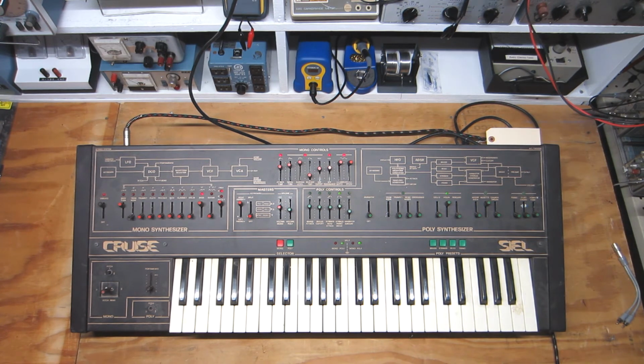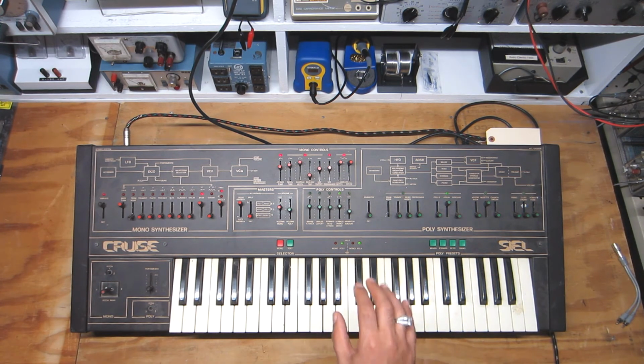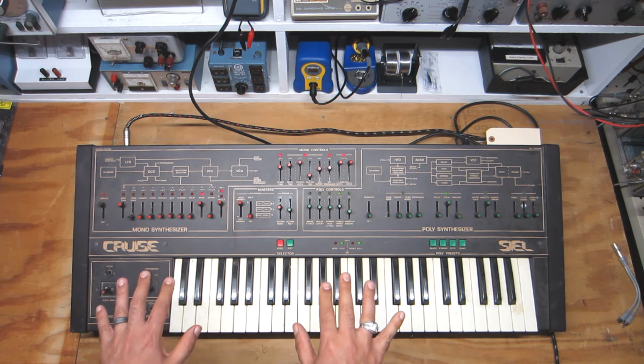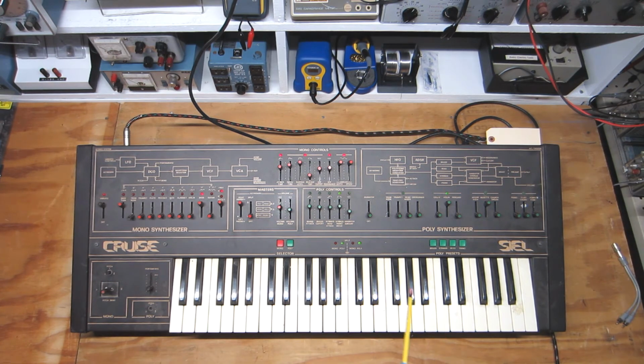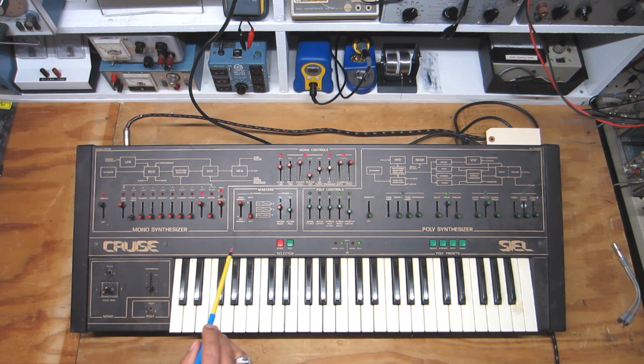So otherwise, let's see here. Yeah, I'll be going through this whole unit, performing my usual detailed inspection, which I will cover in the next video. And of course, I'm going to recap this thing, replace any other components that require such. And, as far as cosmetics, let me see here. Yeah, this trombone switch here is missing a knob. And these colored inlays are missing on this knob, and this knob. And I do believe that's it. So, yeah, cosmetically this thing looks pretty good, other than a good detailing and all that.